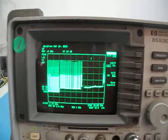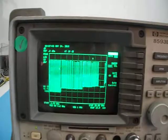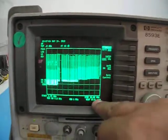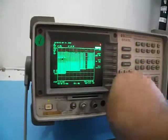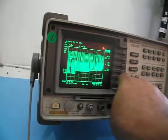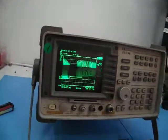As you can see, it's a very, very nice frequency response — very flat. It's a very good one, and it's working up to 23 GHz. Currently it's up to 20 in this test because my signal here is 20. This one goes up to 26.5, so it's actually measured even beyond that, but you get a hole after 23. And then it will be back again at 25, 26 GHz, so it can do that as well.